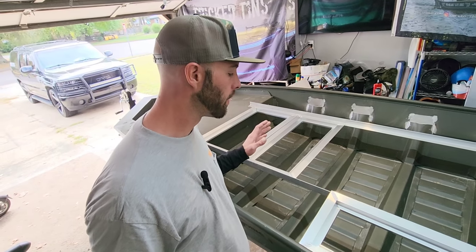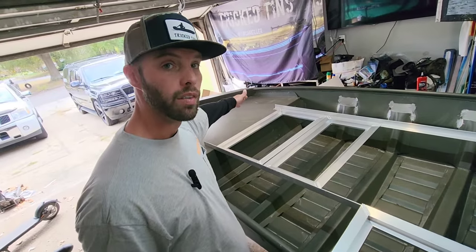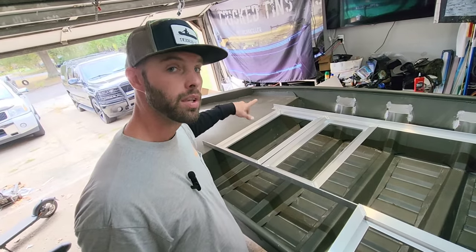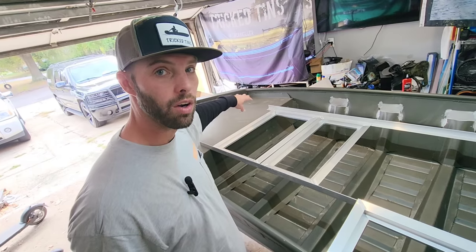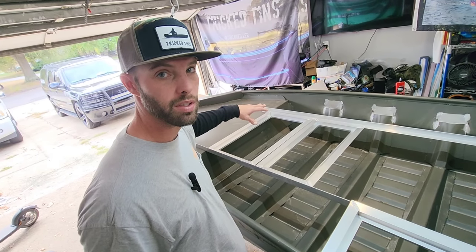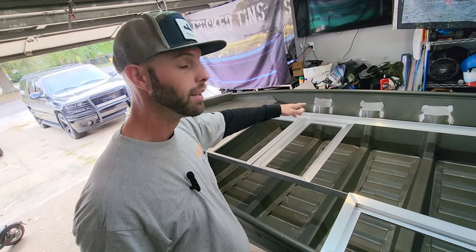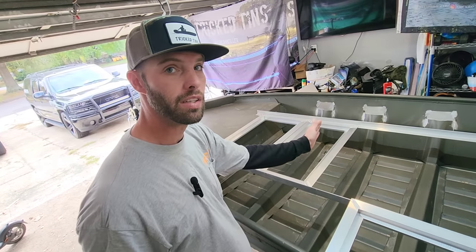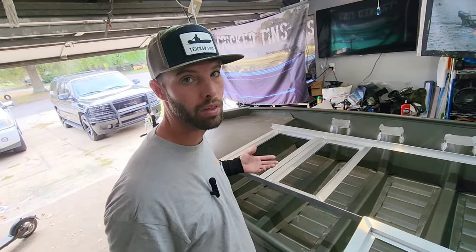So I'm going to put one of these pieces of angle right across this front right here of the rear deck. I'm just going to attach that with two rivets just to temporarily hold it. Then I'm going to frame back off of that with some 1x3 1/16 tubing to get my main two runners from point A to point B. Then I'm going to put another angle across the face of it. Then I'll probably fill in both sides with another piece of the same 1x3 tubing.